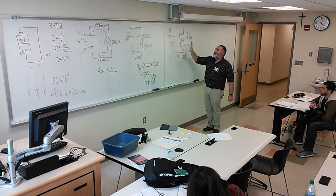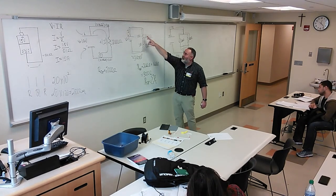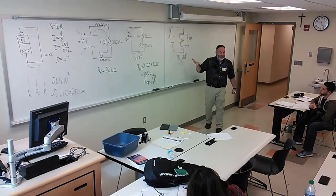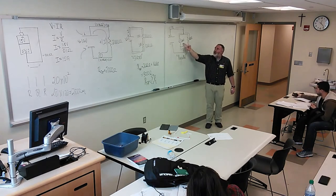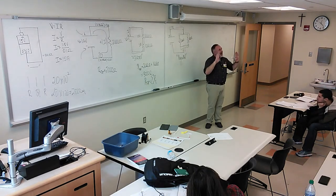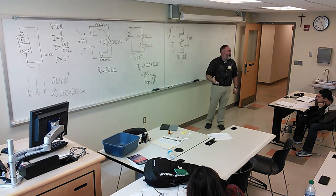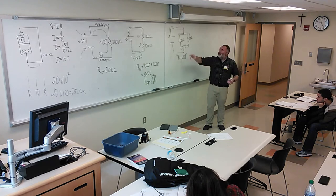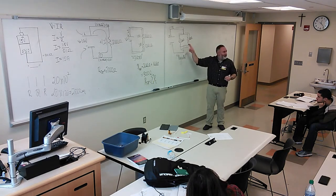All right, I know you guys can use your eyes and you can physically tell there's a different thing going on between the series arrangement and the parallel arrangement. Some of you already know electronics, so I'll ask everybody for their gut reaction. When we put two resistors side by side in parallel, what does your gut tell you for the total resistance of the flow? Does the total resistance go up and slow things down by adding an extra resistor next to it? Or does the total resistance go down and the flow goes up by adding another resistance next to it?